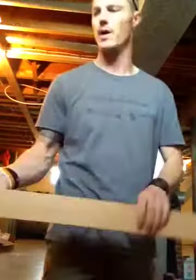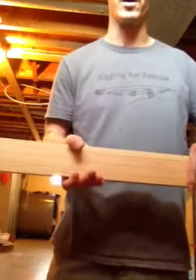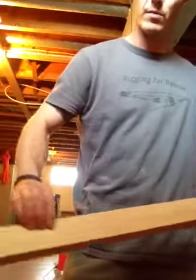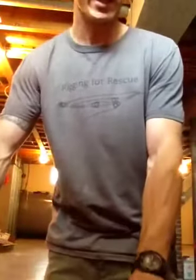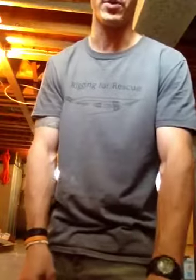So if you have any questions based on this video, on the measurements, or the materials, or where to get them, or how to cut them, my next step here is going to be taking this to a friend's wood shop, and I'm going to rough out the design with a bandsaw. Then I'm going to take the template down to the lines using a wood rasp and sander. And then once that's done, I'm going to glue a riser block on the handle of the bow using 1.5 inch finished oak and maple layered.